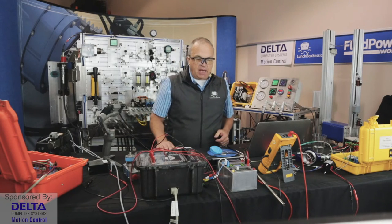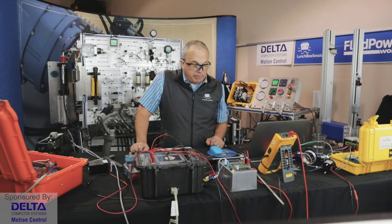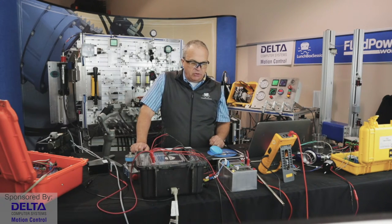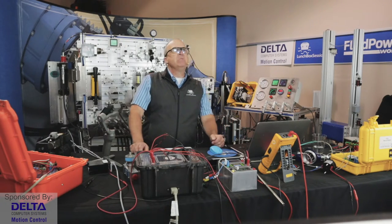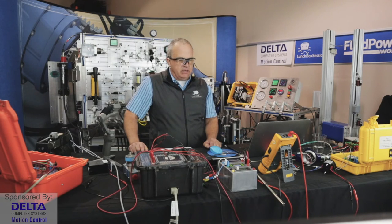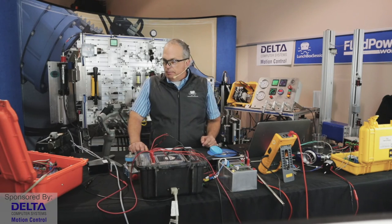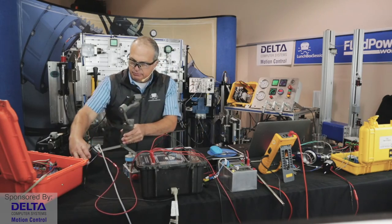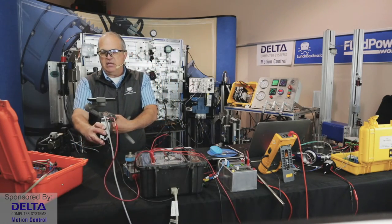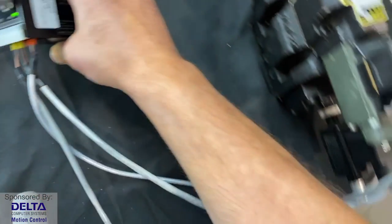And so, questions coming in. Let's have a look. David Steger is asking, will you be reviewing proportional pulse width modulation solenoid controls as it relates to pilot hydraulic functioning? We did one on that last summer, David, PWM control, I believe, but I probably will make reference to it because we're going to open a Parker application for an amplifier in a little bit here, so stick with us, and we will indeed make reference to variable current drive for solenoids on a valve that you see there.